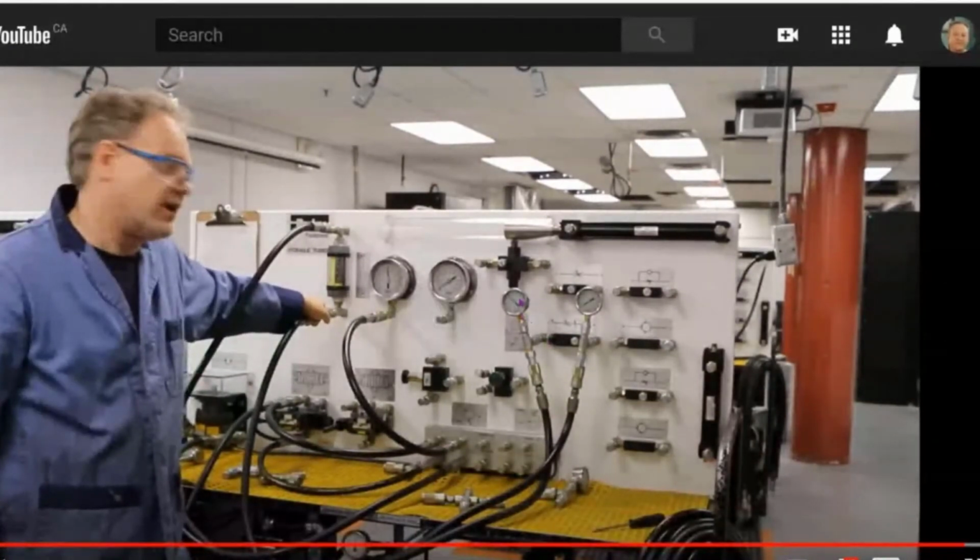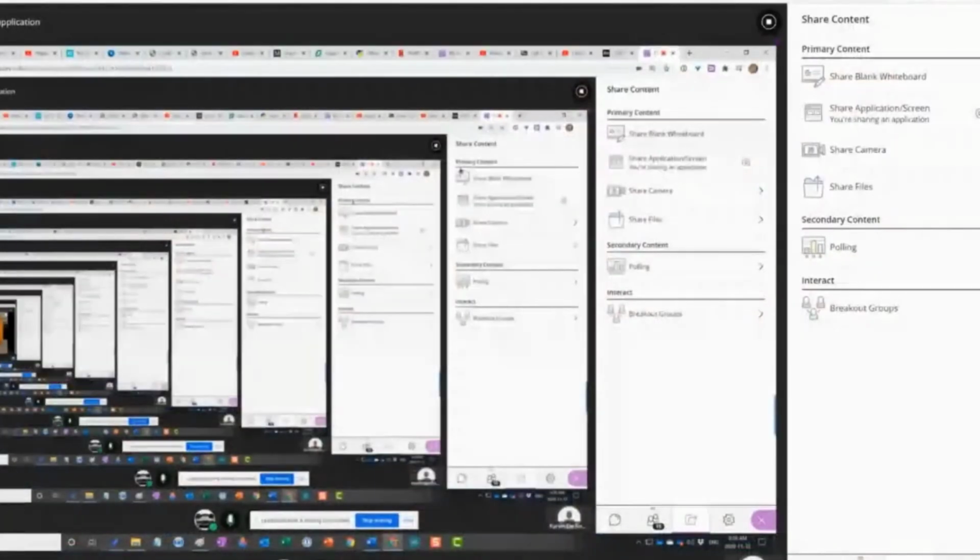So cool. Like I said, the pressure goes up here. I think I said that we're going to see pressure here, but I meant to say that we're going to see a high pressure over here. So the pressure drop across this is greater, just like the voltage drop across a resistor would be greater. Essentially, it's kind of like a pot: there's a controller that runs over to the pot and changes the resistance of the pot depending on the voltage.